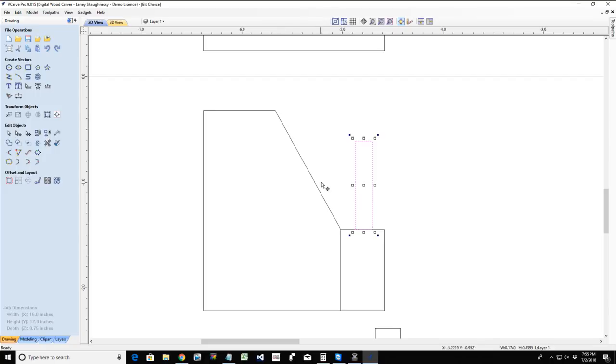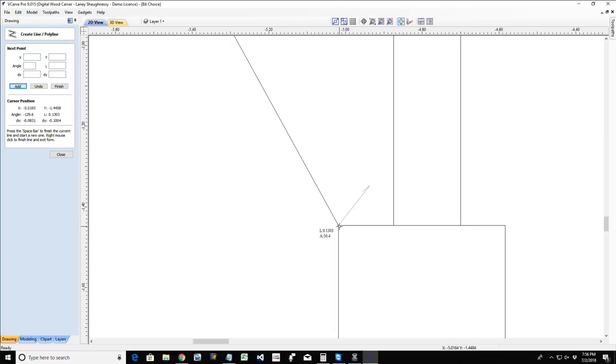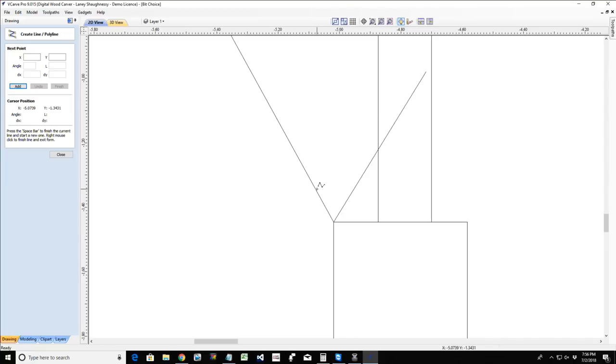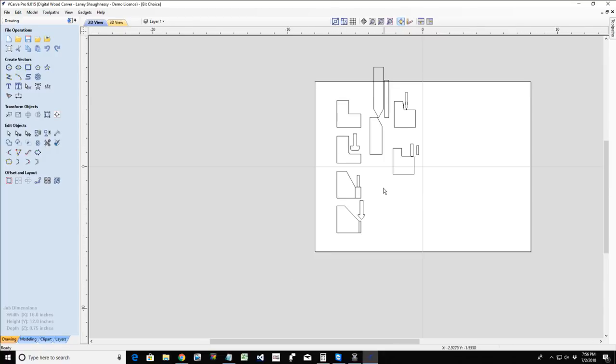But what if I wanted that nice V-shaped bottom? I didn't want a flat depth. I want that nice V-shaped cut in my acrylic. Well, then I need to use a wider angle bit. So if I'm doing big letters in my lit signs, I'm generally using a 120 degree V-bit when I'm carving, so that it gets that nice V-cut, but it's going to be shallow enough that it's not cutting through my material. It's just a matter of what it is that you're wanting to do and what your end result's going to be.